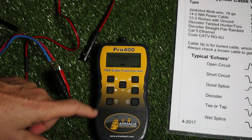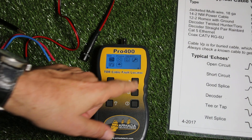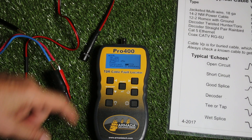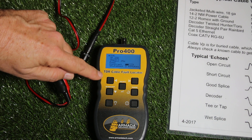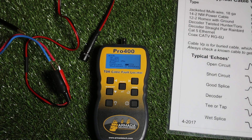Turning on my unit here, turn on the backlight, we are going to go to the menu and I'm going to step across to the wrench setting, select it and look and see what we've got set. I can step down this menu and make changes in all of these things. But what I've already done is change the VP to 57% and the impedance, which is Z, to 25 ohms.